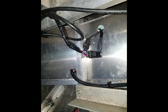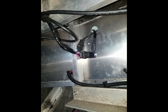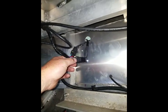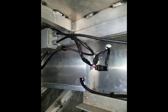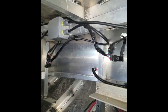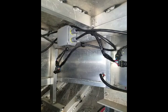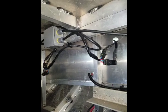The reason I did that, all right, each one of those plugs wires 2 light fixtures. If I have a light fixture go down, I can come here and unplug one of them, and I've still got the other one working, and it does not affect the rest of the circuit at all. I've got, in this setup, 4 boxes and 3 drops off of each one, and then each drop runs 2 light fixtures. So that's a lot of lights.